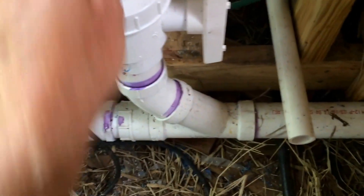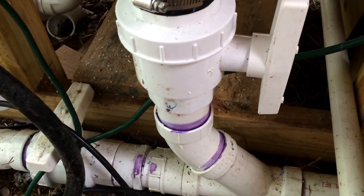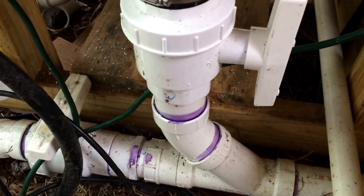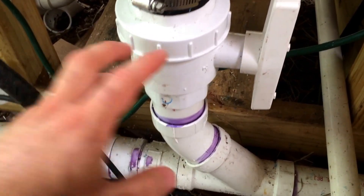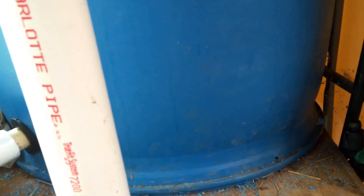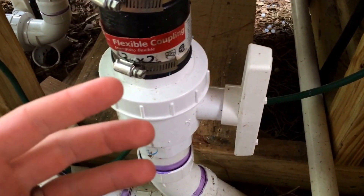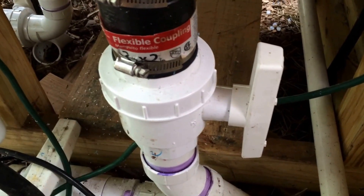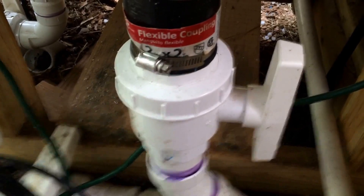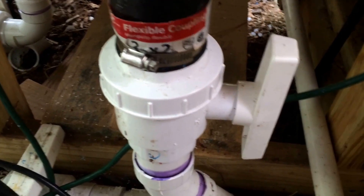Since I was cutting all this and working on it, I went ahead and added a valve here. I didn't necessarily need it, but one of the things I found was that if I drain the system without this valve — if I just crack this open and want to drain out the dump line or drain one of the tanks — it would first pull a siphon on the swirl filter and drain it down until it broke the siphon. So by having this valve, it will save a little bit of water and a little bit of turbulence. I can just cut it off real quick, do whatever else I need to do, and turn it back on as I see fit.